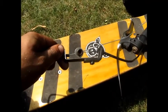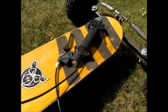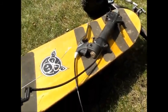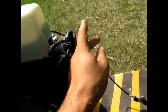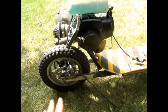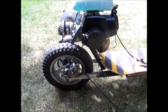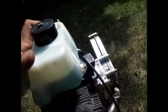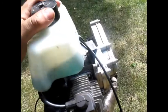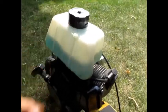This is kind of a temporary thing I did — this is just to marry the throttle cable that was built into the Homelite weed whacker throttle handle to the throttle cable that came with the motor. Most of it was cropped from one of those pocket dirt bikes or pit bike deals. The gas tank is just kind of a temporary fix; I'm actually working on another gas tank for it. This is just a piece of plate that I welded onto a bracket and zap-strapped the gas tank onto.